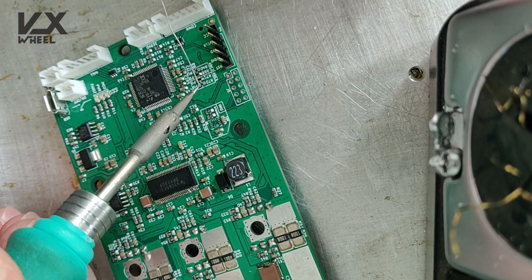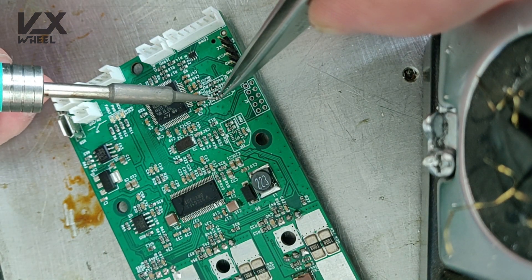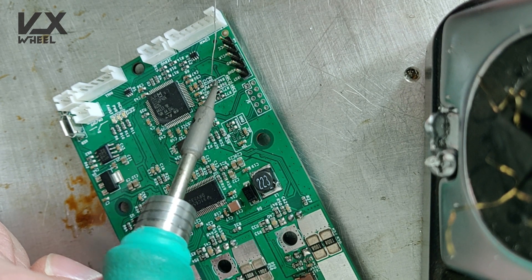The value of the pull-up and pull-down resistors depends on the footpad sensor that you're going to use. I use 25K for the pull-up and 1K for the pull-down.